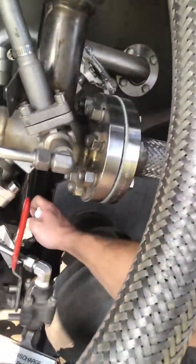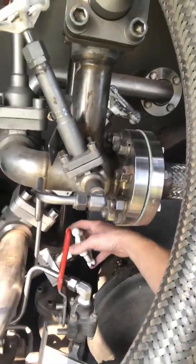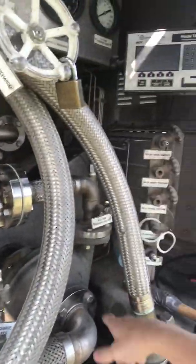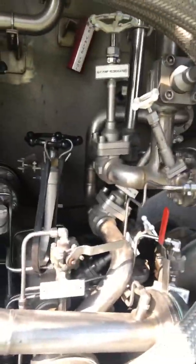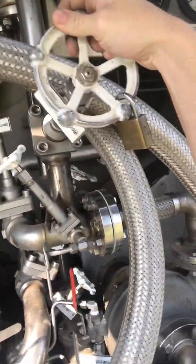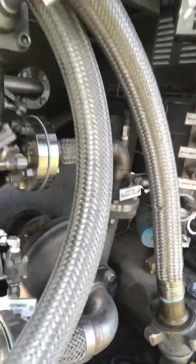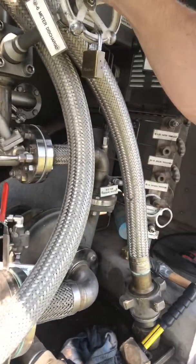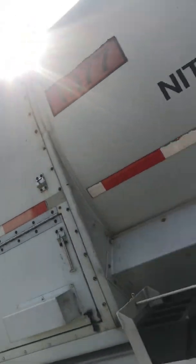I like to put pressure behind my pump, so I'll open up my pressure builder. Then you hook up your main line. Once you get your pump cooling down — takes about 15 to 20 minutes to cool down — it'll be iced over, kind of like that back there. So you wait for your pump to ice over, then you go in your box here and fire up your pump. Start it out at an idle and then follow it down.